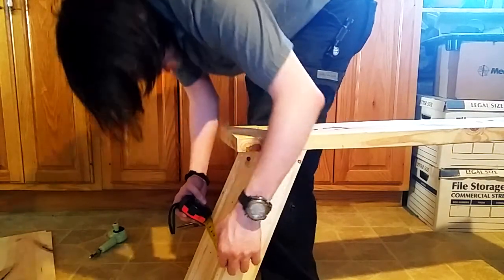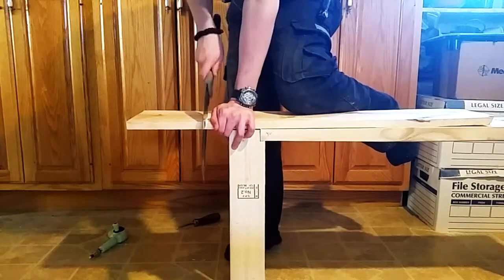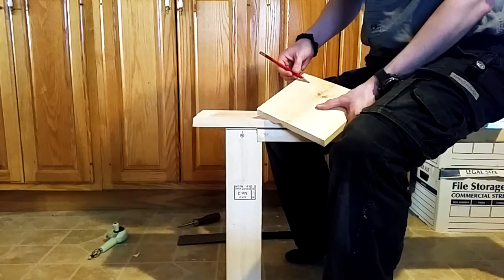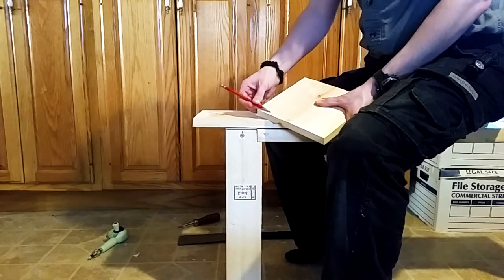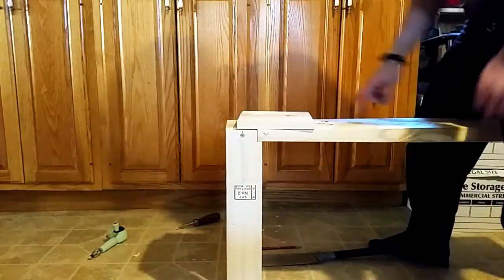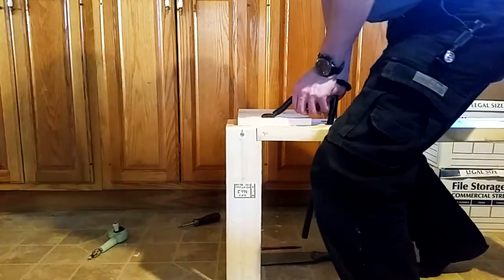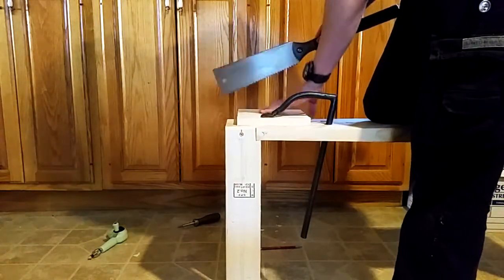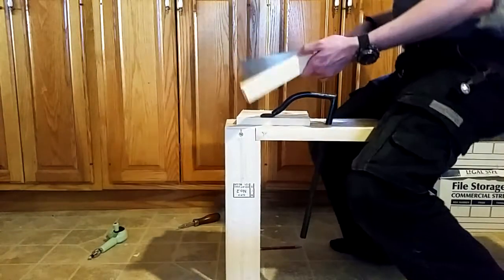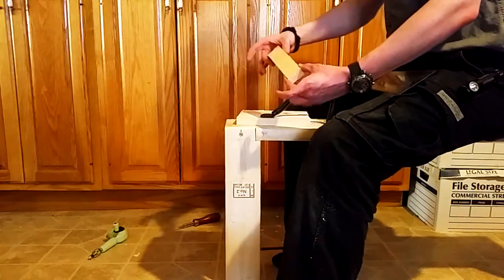On the upside here, seven and three eighths. I only need some little strips. I forgot one of the basic benefits of the system that I have already - these dog holes. And because my aim is to be quiet here, I'll line it up and press it into place. And that ought to do it. I'm still going to put my hand here as a dampener for the sound. There - that's my little stretcher. I'm going to cut some notches into these legs, set that in, and screw it down, because all it has to do is resist a tiny bit of motion this way.